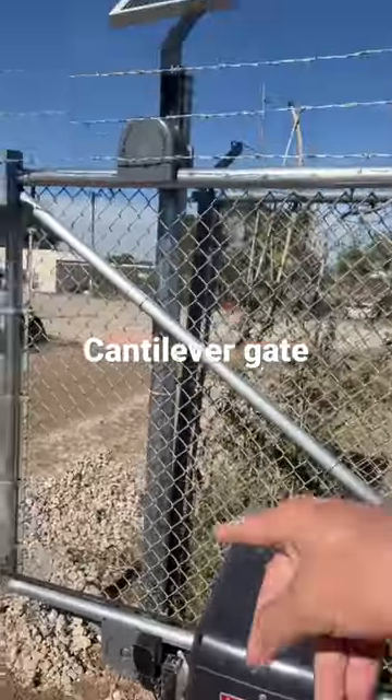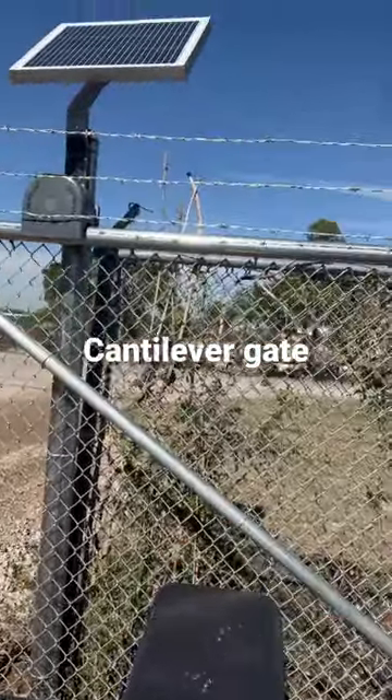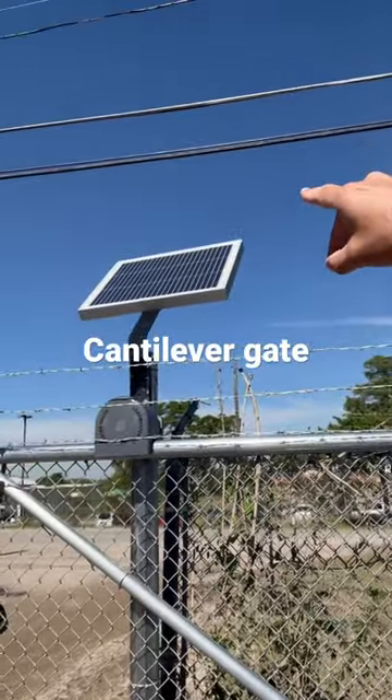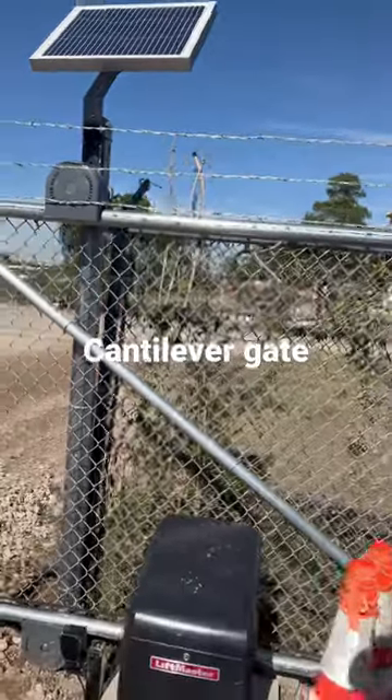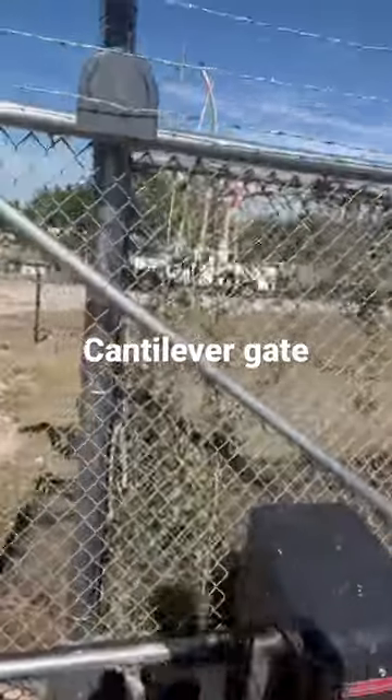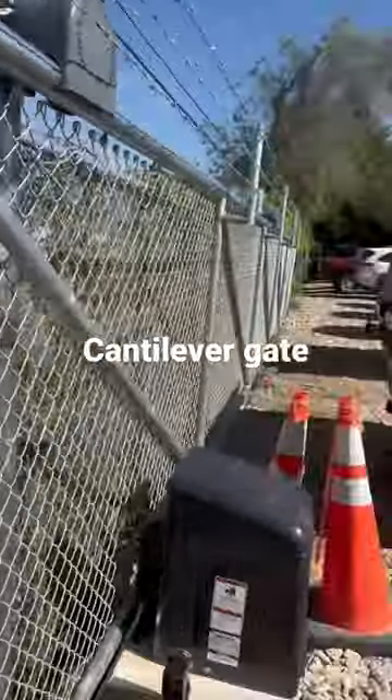So what you all can plan on — it'll have a photo eye across it. This unit here, we put a 40-watt panel up on top. And right here, we've got two 35 amp hour batteries underneath this covering to allow this 30-foot opening gate to work.